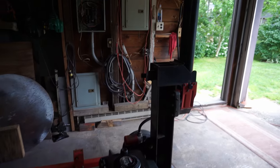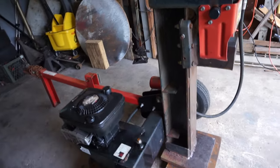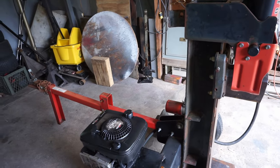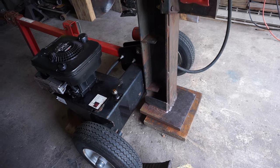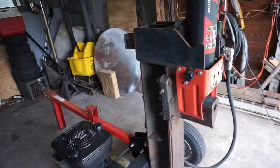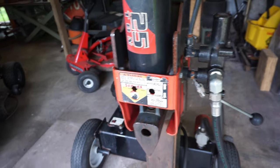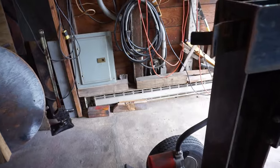I got this baby loaded up - this is how you would operate it when you've got big logs. I don't know if they're supporting it properly, which might be another problem. It's not safe if you're not supporting it right. It doesn't touch the ground so you have to have something underneath it. I can also see a number of areas that are wearing because they're not lubricated - keep an oiling can with you and oil it before you use it.